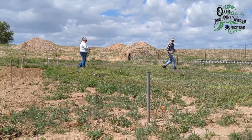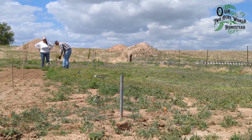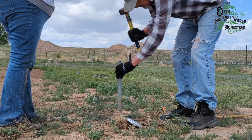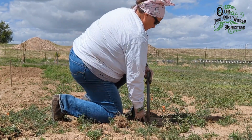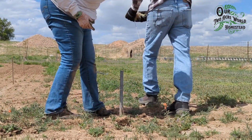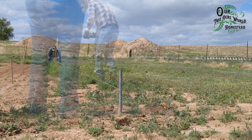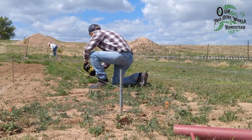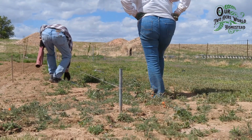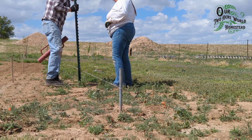We then went about the task of measuring everything up so the arbor was square to the fence line and would look uniform and straight when complete. We staked out our corners and drove scrap pipes into the ground to secure our string line to keep our T-posts in a nice straight line. We then drove our first post in using a T-post driver.